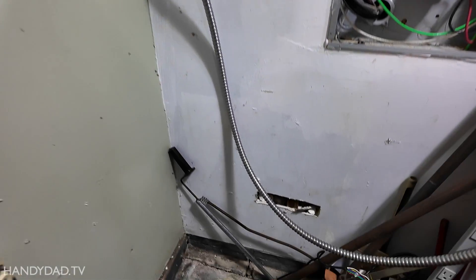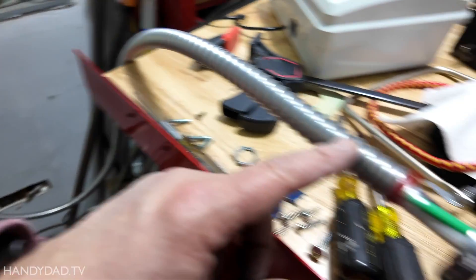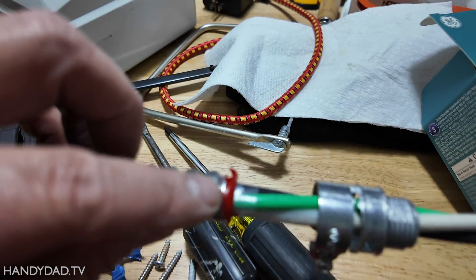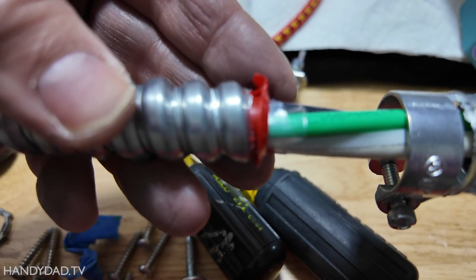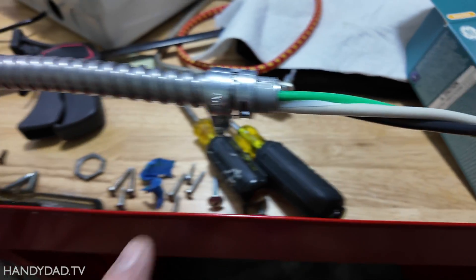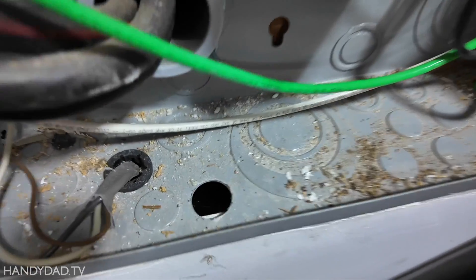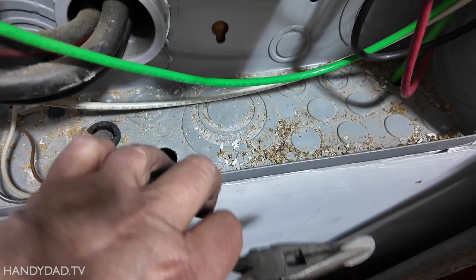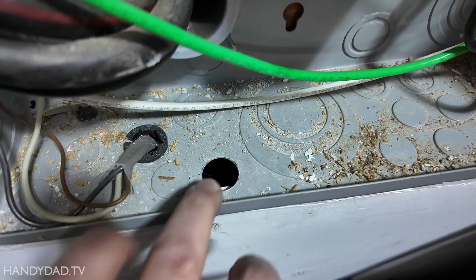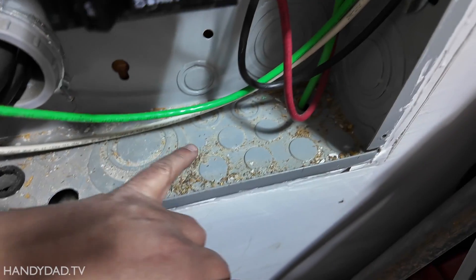At this point the wall connector is in, and my cable comes down the wall and is going to go through a hole at the bottom and up through the panel. I measured the length and cut the cable with a hacksaw very carefully — you have to be careful not to nick the wires. I put a bushing or grommet in there, then I'm going to feed it up through the wall. The knockout is the right size, but my sheetrock is in the way, so I may have to use a different knockout and put a cap in the other one.